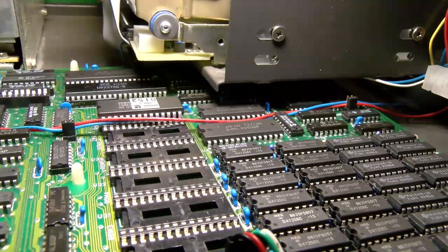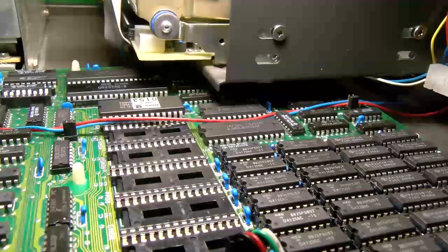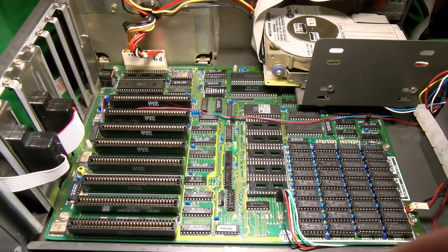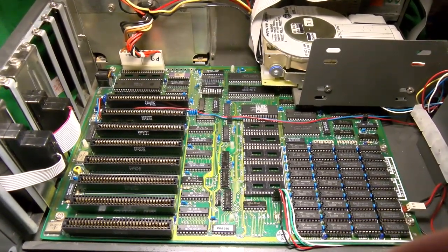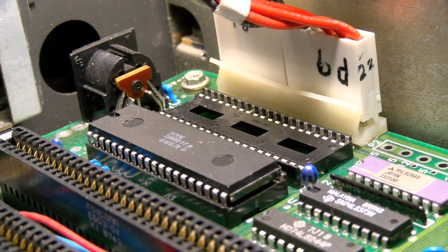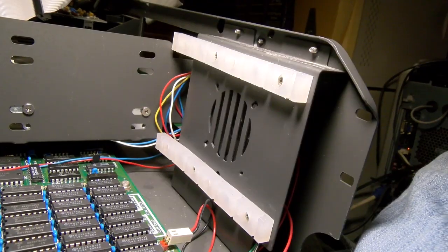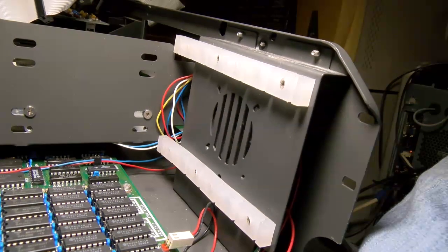Of course, machines like this one do deviate from IBM's specification a little, because the original XT only ran at 4.77 MHz, just like the original PC. Turbo XTs are where the clone makers really started to get the hang of things, when the white box machines became viable and started to slowly transcend being simple clones and move towards being compatibles. This one still largely looks like and works like the IBM 5160 did, but it's things like the clock boost and memory support where you can see the off-brand systems starting to run off on their own with their own ideas, even if only a little, and, well, certainly the lower price point they might have been able to sell it at, and these extra features are probably enough to sell some units and get a foothold. It certainly had an effect.